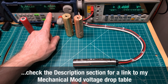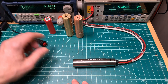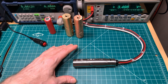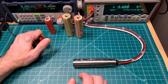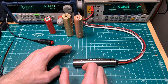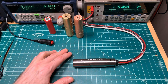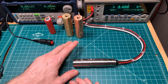This is an electronic load that draws 30 amps from a power supply above it. To prevent arcing damage from affecting my test results, I close the contact in the mech and then fire a two-second pulse of current at 30 amps. By using this electronic load and these two-second pulses only when the contact closes, there is no arcing. When the pulse stops, I open the contacts, letting me repeat the test as many times as I need to, knowing there's no arcing inside, until I do a separate arcing test.